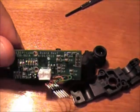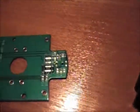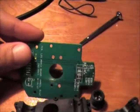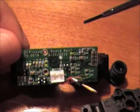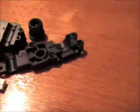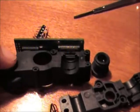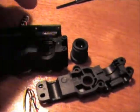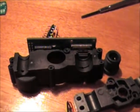Here's that bottom board that the whole thing sits on. I've pulled everything off of it and measured everything about it — everything's catalogued and I drew up a schematic of it. I plan to do the same for this board. Other than a couple of little transistors that might be hard to identify, capacitors, a little inductor, resistors — everything else should be easy to figure out. Then I'll have a bare board which I can create a schematic from, and that will give us something to potentially play around with — possibly just remounting a board in this same enclosure with one of these image sensors from Panavision, and starting to work on our own replicated design.